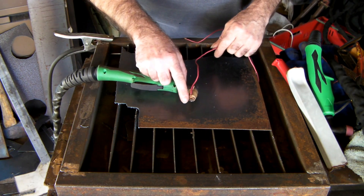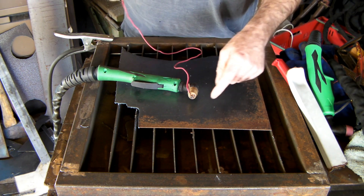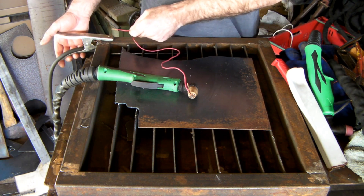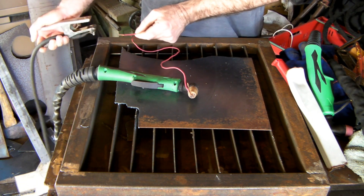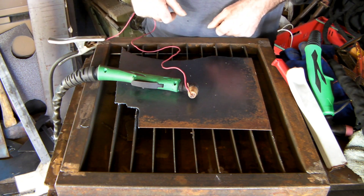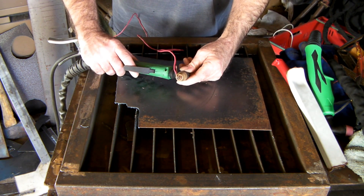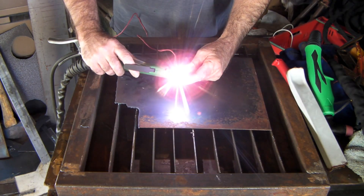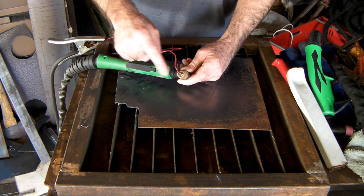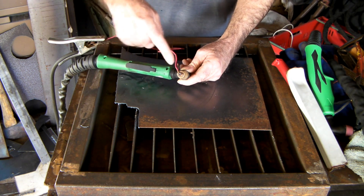Wrap your wire around the nozzle end and make sure you check out that other video in the link for more detail. The other end of the piece of wire just clips under your earth clamp — clip it on your earth like so. Now remember we pushed the button before and it did nothing — now we'll push the button and see what's happening. What it's basically doing is tricking the torch nozzle into thinking it's already touching the work, because you've hooked it straight to the earth.